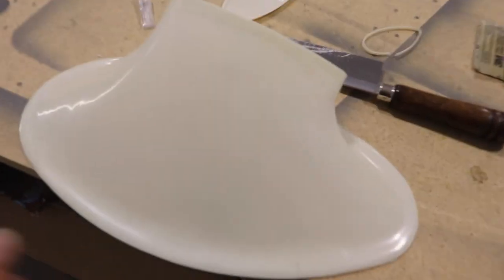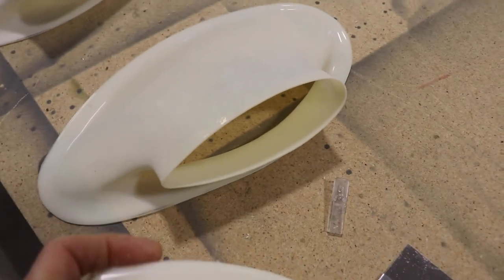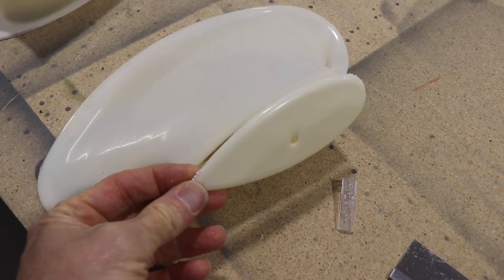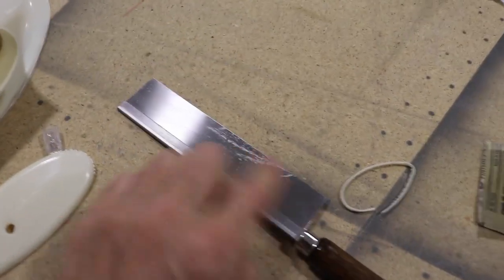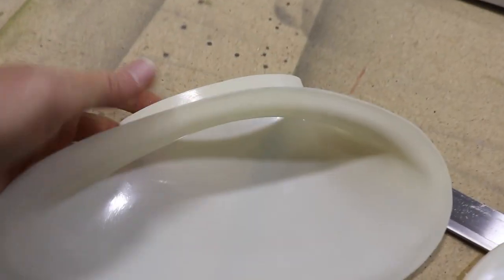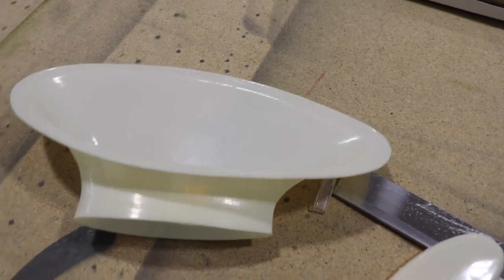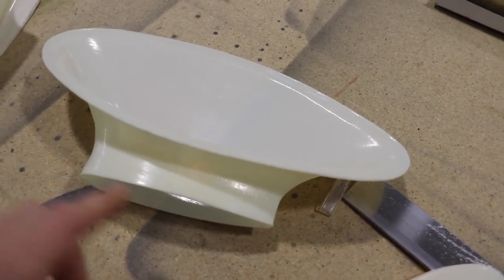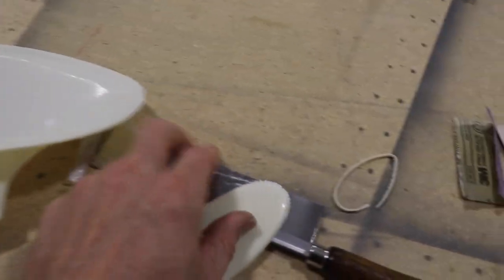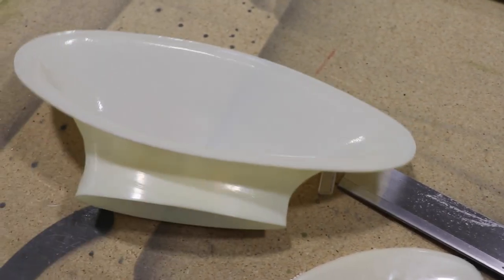What I'm working on now is the main forward wing strut fairing, and this is put on exactly like the aft one, so I probably don't need to show you too much. All I did was take my little saw and just sliced off the end here. The next thing I'll do is cut it and it should slip right over the strut. I might have to trim this back a little bit more - I try to take as least amount off as I can, and then trim again if I have to.